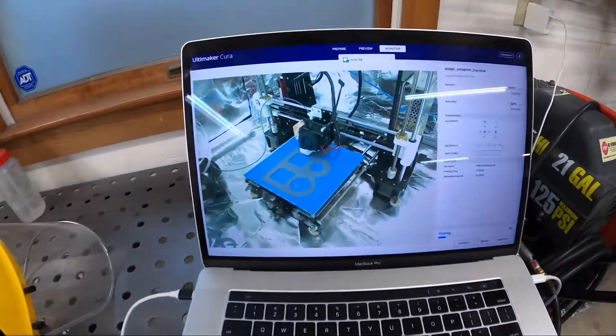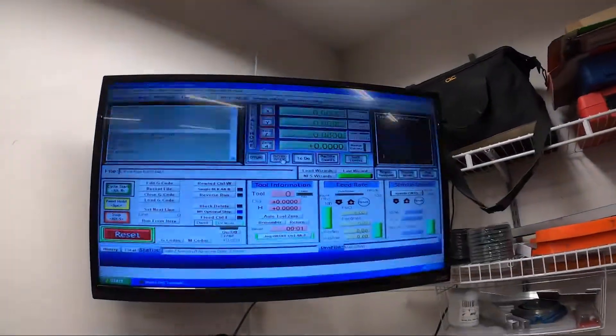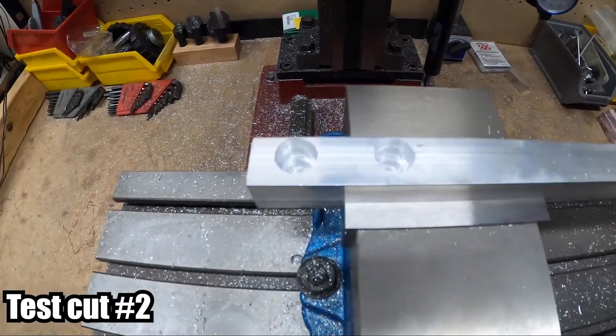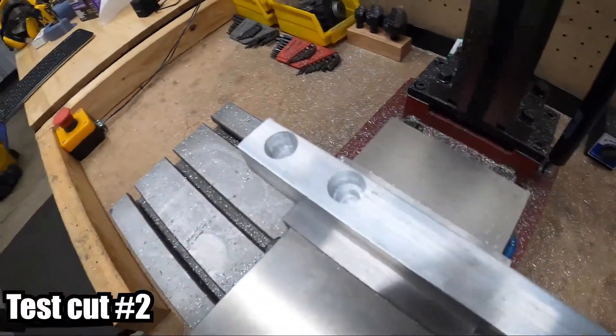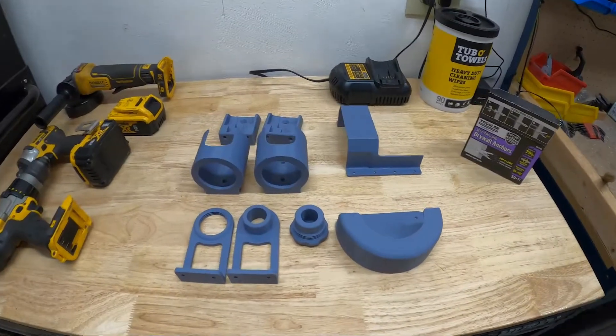The 3D prints are still going good, no issues. That went pretty well, but I'm going to turn backlash compensation off in Mach 3 just to see what it does. A few moments later — that was definitely a lot faster because it didn't have to compensate for backlash, but the surface finish is still pretty terrible.